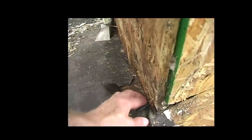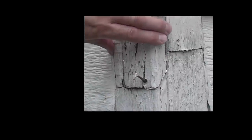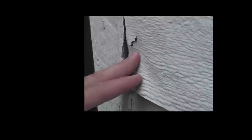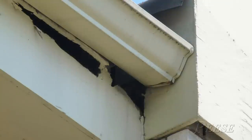If you want to stop building disposable housing, you need to understand that roofing, siding, house wrap, and metal flashing will keep about 98% of the water out of your homes — kind of like having an umbrella with a few holes in it. Better than not having an umbrella, but you're still going to get wet. The 2% of water that gets past these products will rot out your walls, rot out your windows, and destroy the house.